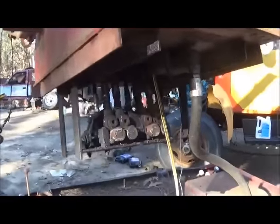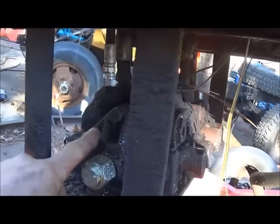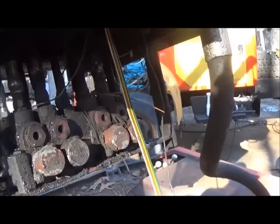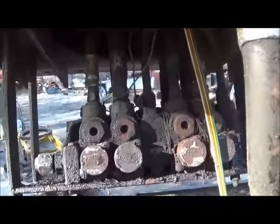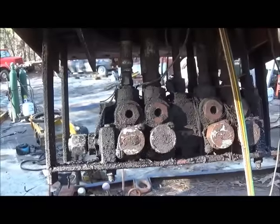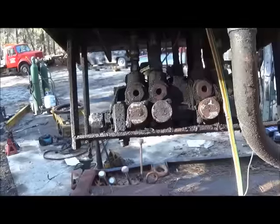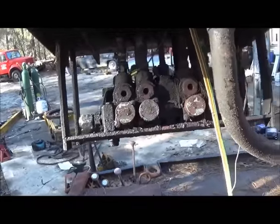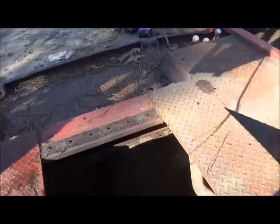Now you can see it's got grease and stacked control valves. You can see these bolts right here — there are three bolts that actually go through and hold this together with O-rings in between. It's a pretty simple setup, just an open-center return-to-center regular two-way control valve setup. You can see it was capped off on this end — that's the return line — and I think he's got the end of the pressure line capped also.